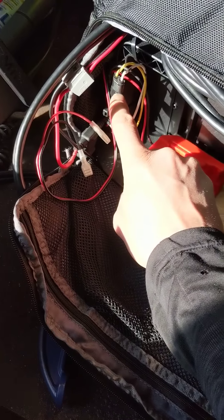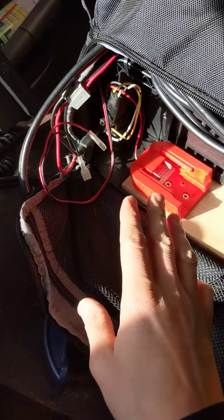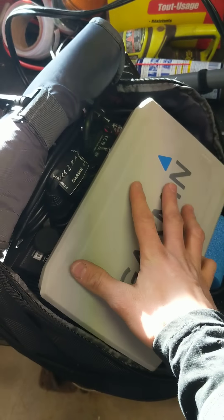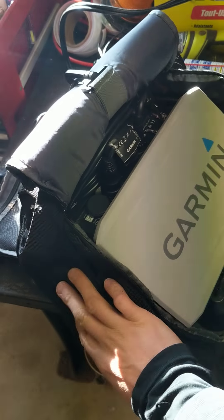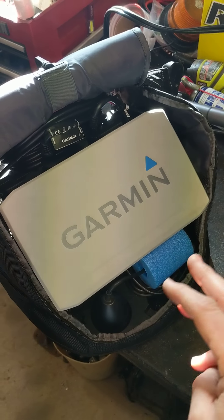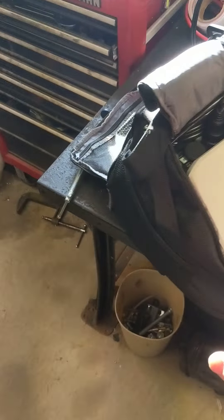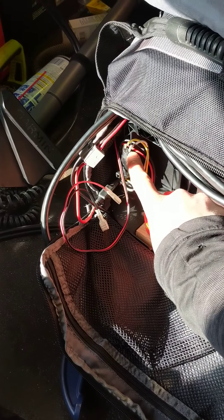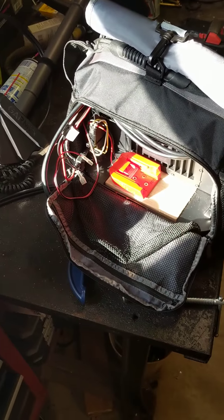If you don't want to do the plug setup, that's fine too. Just attach your same red and blacks, just like they were, to the red and blacks from your LiveScope box and the red and blacks from the power cable that goes to the Echo Map. That's all you need. I just had the cables in the breakout connector that they give you, which is very nice. So I used it. Didn't cut anything, didn't add anything. The only thing I added separately was this mount and that half of the connector to connect up to what Garmin already supplies you with.